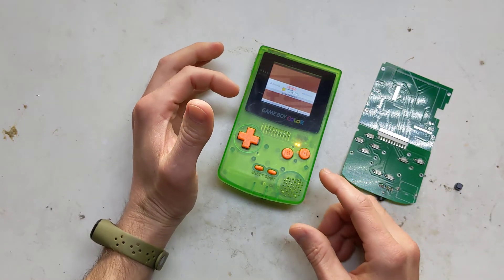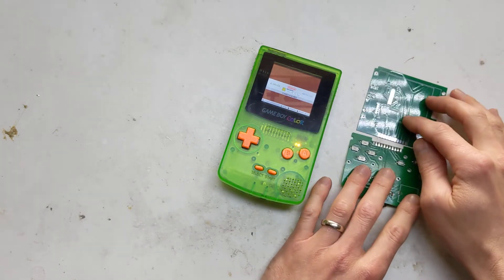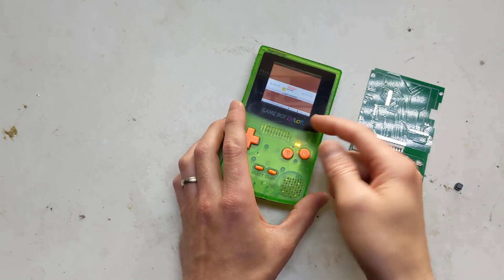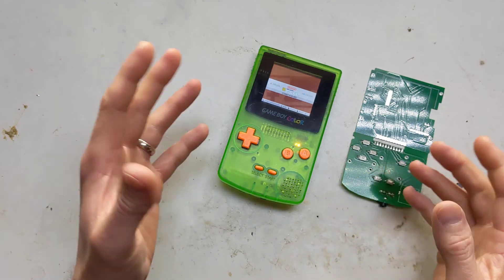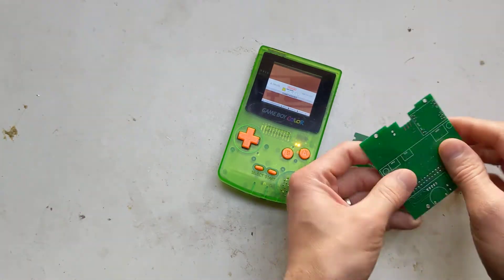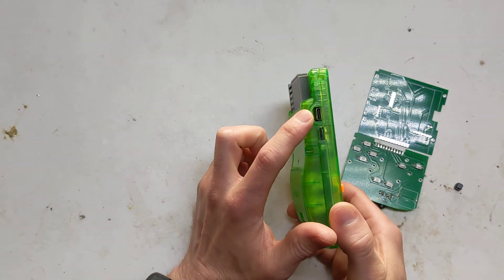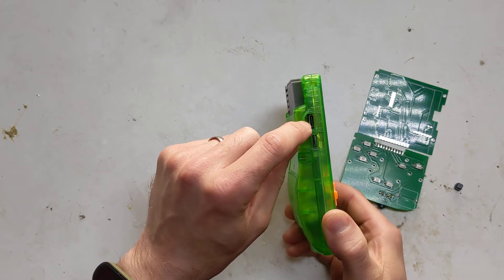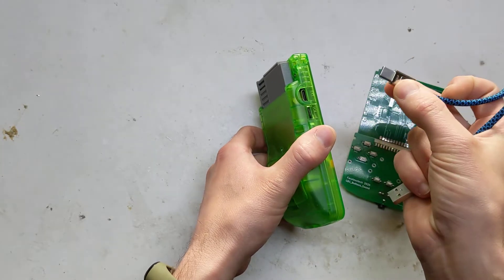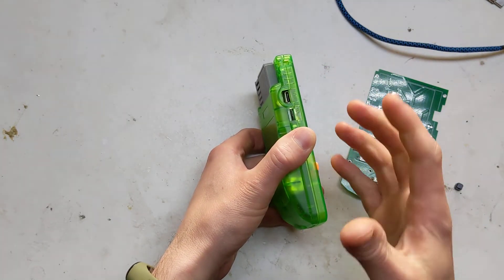There are some modifications to the case. The power board spans the two boards and kind of hangs off the edge of the top board. It's quite a tall board - the inductor coil actually sticks out, so I had to drill a hole through the case, and behind the screen it actually does stick to the back of the screen. The power button I had to put right over here - it actually sits partially under the screen, but it does work. I changed the multi-port connector for a USB-C port, but it was recessed too far back for a normal charge cable to work. Luckily the ones I made myself fit in because they're quite long and skinny. In the new build I'm going to push that over the board a bit more so it'll stick through the gap more and should be able to fit any cable, which is nice.